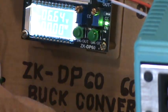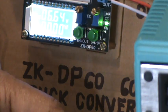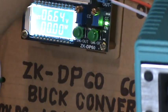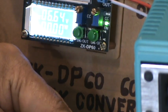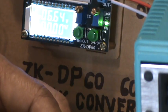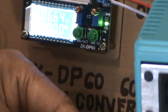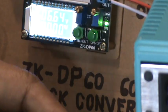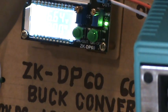The AM FM is actually now set to FM. Hopefully it's not music. And this white thing here needed 6 volts, and we will inject 6.64 emanating from the buck-boost converter. Okay. I now place the terminal. I will place this one to FM.